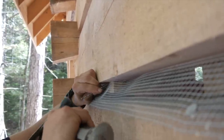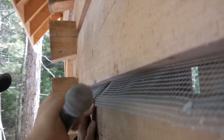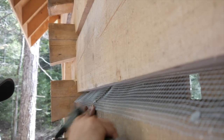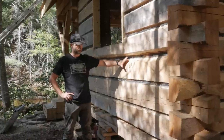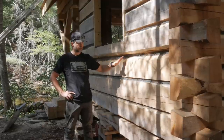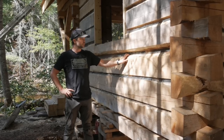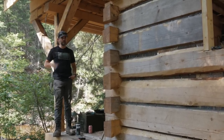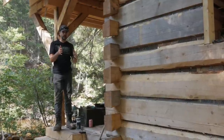Metal lath is just one of many ways to accomplish this. I've seen other approaches in real life and on YouTube. A local guy just used spray foam and nails with no lath. Historically people used rocks, moss, or anything to fill the gap as backing for mortar. I don't think this is necessarily the best or only way, but it's one I've seen done fairly regularly. I'm starting by chinking the outside, then filling the rest of the gap with insulation, then doing the same process inside.